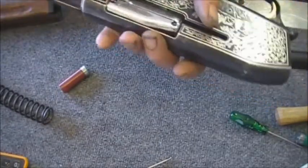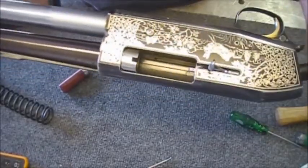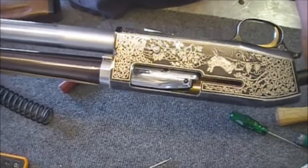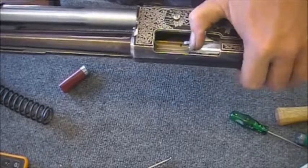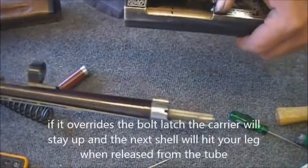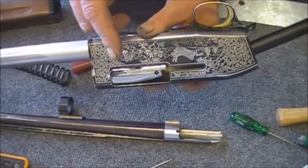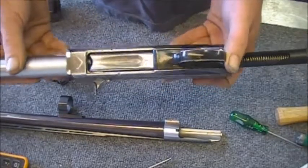If we do that again real fast and real hard like it normally would — see our bolt come forward? We're pulling our bolt. So on this gun, half the time it works if everything locks up and lets go, and half the time this just comes forward with my spent case still in the barrel. So when I pull my handle back, I've got a spent case sitting here and a loaded case sitting on my carrier. That's one of the things that makes these, when they get this worn, not cost effective to repair — because the amount of time redoing the ejector, redoing the extractor, checking the timing, the gun's not worth that amount of money.